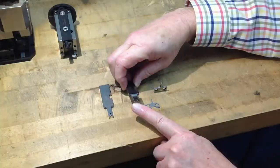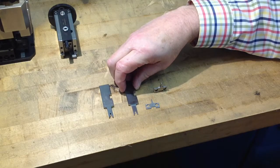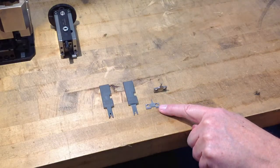I'd like to introduce to you the pieces in the applicator that actually perform the precise crimp that you're trying to achieve on your TM3000. The pieces we're referencing are what we call perishable tooling, and in this example we have two punches and two small anvils.